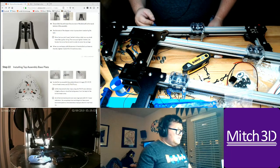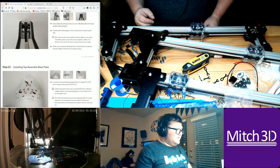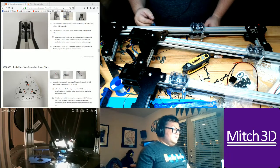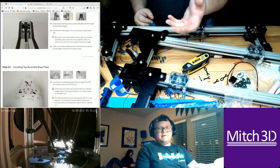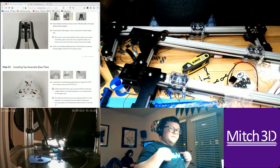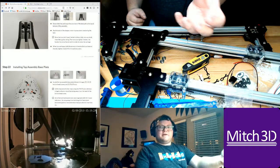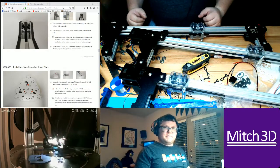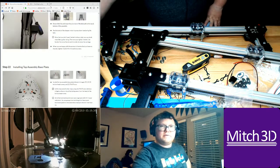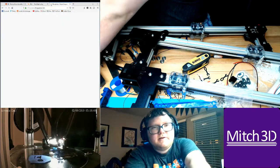I think there's an upper limit of what you can do with a Delta. So for this case, the lighter it is, the less inertia I'm going to have when I move it around on my back. If I'm jogging or walking, I don't want the hot end to have a bunch of mass and skip the motor.